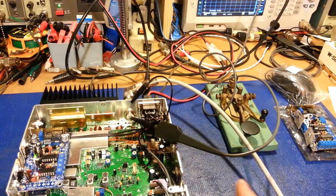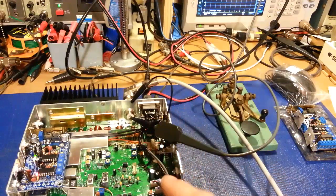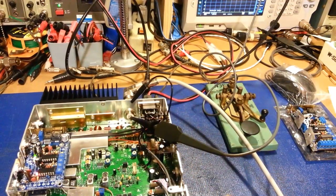Now, I will say, on Spectrum Analyzer, I'm not talking broadband as in lots of harmonics. So I'm not talking about a lot of harmonics out at 54 megahertz, your second harmonic. What I mean by broadband is it's transmitting broadband audio, good or bad. Honestly, the channel spacing of a CB radio is 10 kilohertz. So that's 10 kilohertz on either side of the carrier, okay? You honestly don't need any more bandwidth than that for fairly good audio quality.